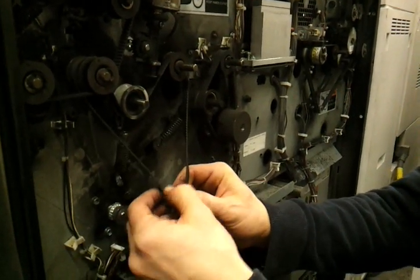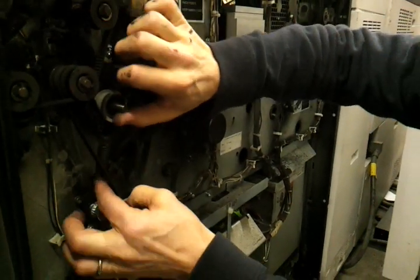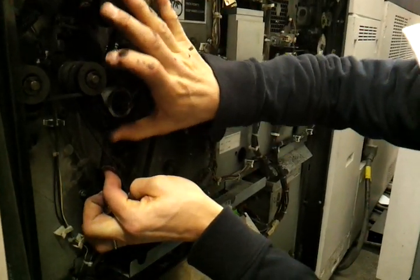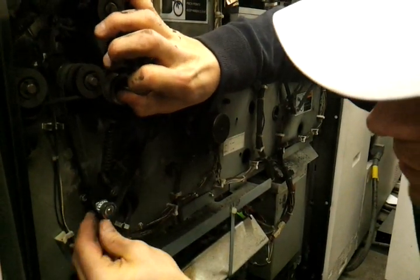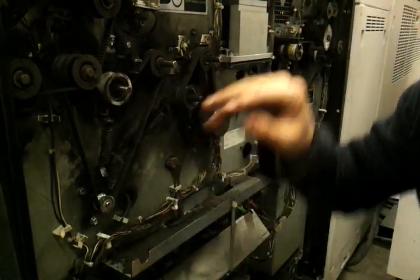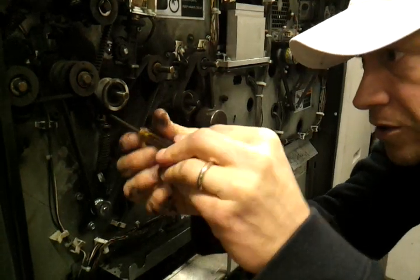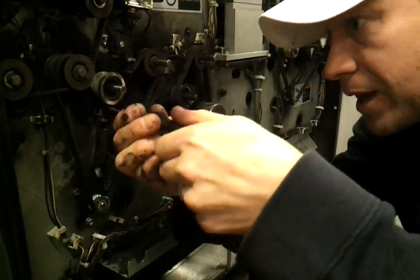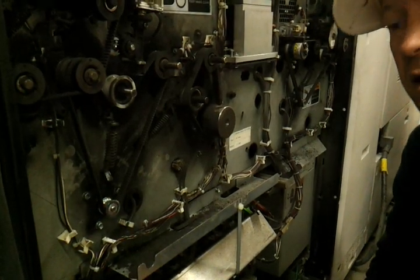Normally, if your belt is in good shape, just disengage the pressure off of this idler pulley, reseat your belt, and then let the pressure come back on. Once the pressure goes back on, there's a screw underneath this pulley that you just want to tighten back down to hold it in place. Then just close your back up and you're back in business.